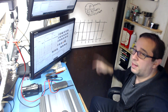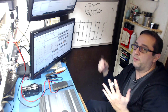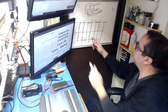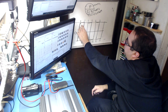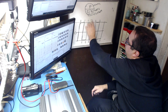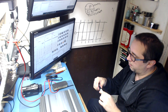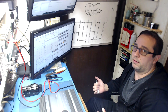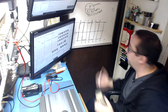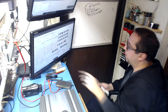They don't like to be on for that duration. If you go lower in frequency, these flat spots stretch out — the on-time can extend from peak to peak. So you are taxing the hell out of your MOSFETs just by going into clipping and distortion, especially if you're using this as a subwoofer amplifier. You've now just turned it into a fryer.